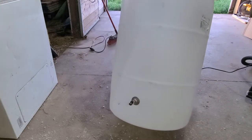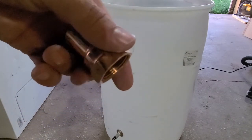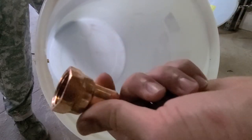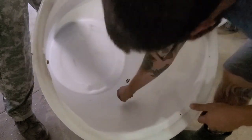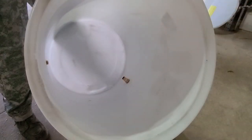What we're going to do is take our o-ring, slip it over the brass fitting on the inside, and then take our copper fitting and push that up against the o-ring to try and form a tight seal. So we're going to take the o-ring, slip it onto the brass, then take the copper fitting, and then take our wrenches and tighten that all up.